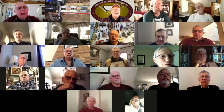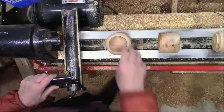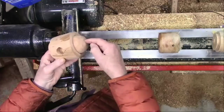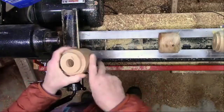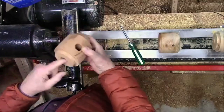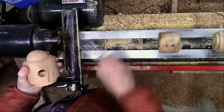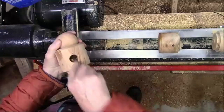I'm going to spotlight my own thing here because it goes right to what you're talking about. This is the jam chuck we were using the other day. After the sphere clinic I did as Kai suggested and bored a hole in the side - I can get a two-and-a-half inch ball out of there very easily with a screwdriver. This fits in the scroll chuck on the lathe and I've got a hole in the back so I can drive the piece out with a rod. I got a not-bad two-and-a-half inch ball out of this particular chuck.